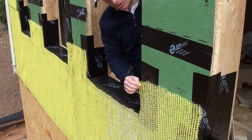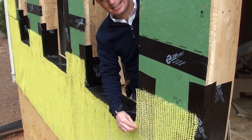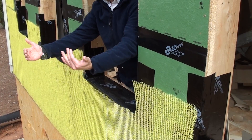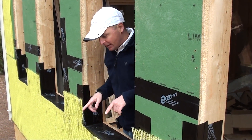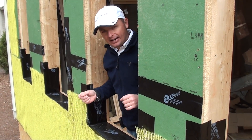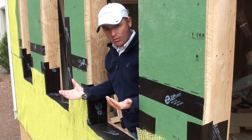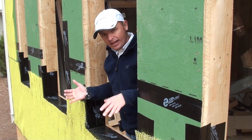This home slicker is actually going to be pulled back — it's right now tagged but it's going to be pulled out. We're going to slide the window in with the nailing flange. But before doing that, we're going to be running a bit of high quality silicone around it so that we can bridge any gap between the nailing flange and the sheathing.